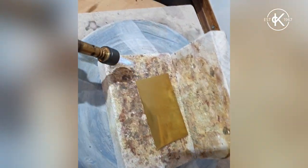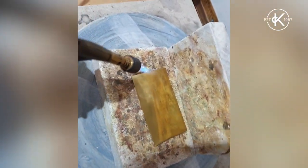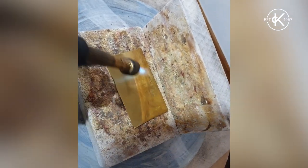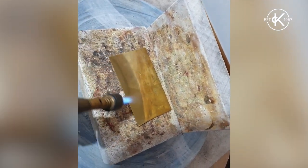So we're going to start with a bead. I've got a piece of 0.5mm brass and I'm going to start off by texturing it. But because it's quite hard to do that, I'm going to anneal this with my blowtorch first. The torch is on — I'm just going to go in and heat it all until it's a nice dull pinky colour. It's exactly the same as annealing a piece of copper or a piece of silver.